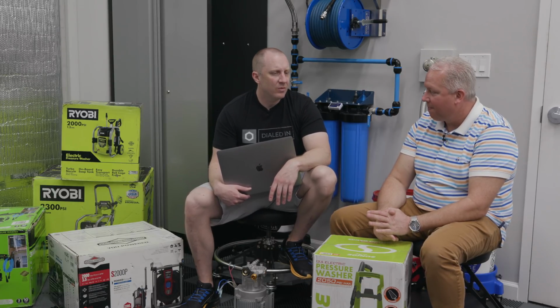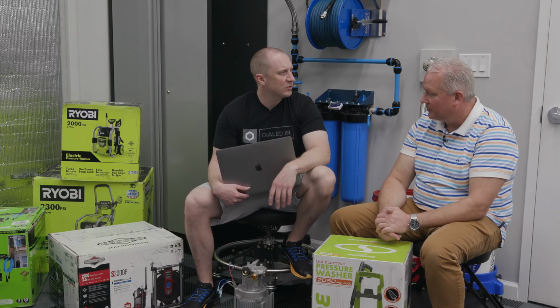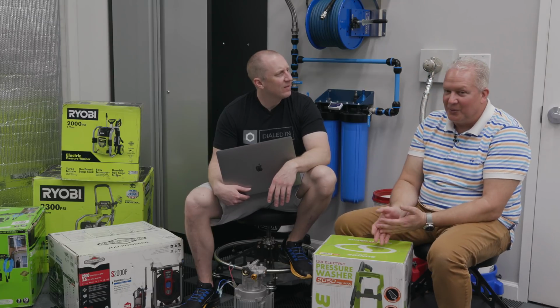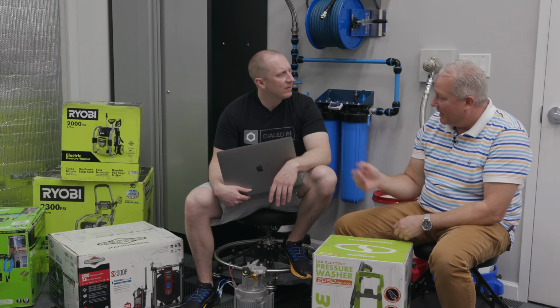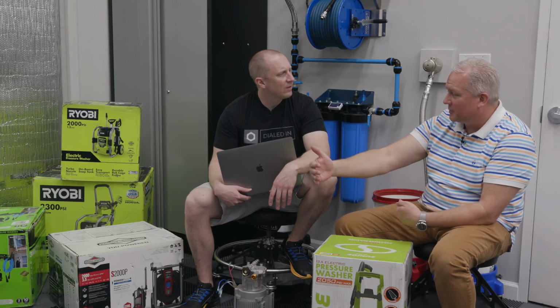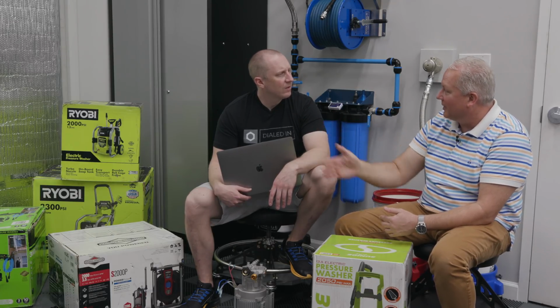Right. I'm recommending people the consumer pressure washer, you're going to be there for days. It's going to take you longer, right? So we were talking about that before, right? Flow is basically speed, right? So when you get up into like that gas unit over there, you have 2.5 gallons a minute, you're going to move a lot faster. So can you do the whole driveway with another pressure washer? Yeah, it's just going to take you twice as long as it would with something that has 2.5 gallons a minute.